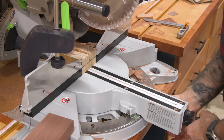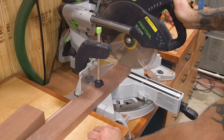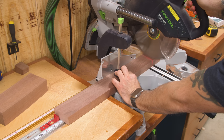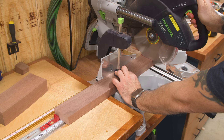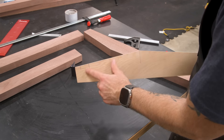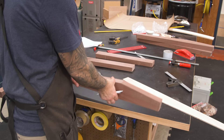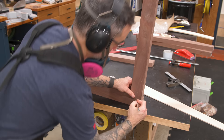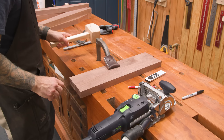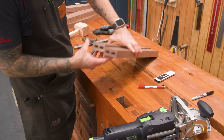The top side rails are then cut to 15 degrees at each end. Save the off-cuts on projects like this as they'll usually come in handy later for clamping. Now let's pivot to the joinery. When angles are involved, there's no easier way to make a mortise and tenon than to use the domino. On projects like this, I love being able to focus more on the overall design and less on the intricacies of the joinery.